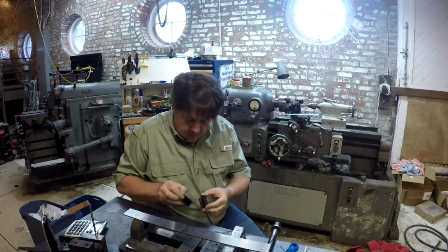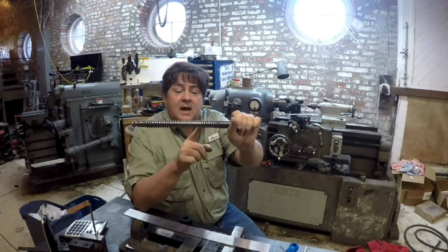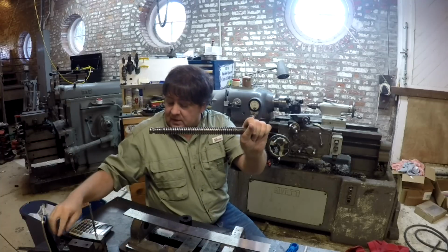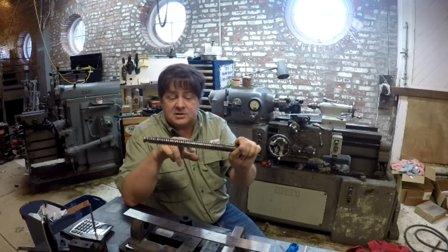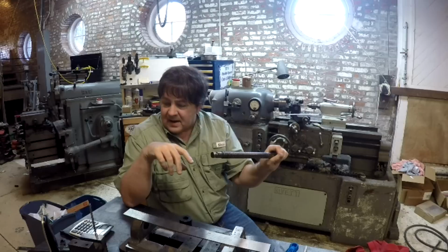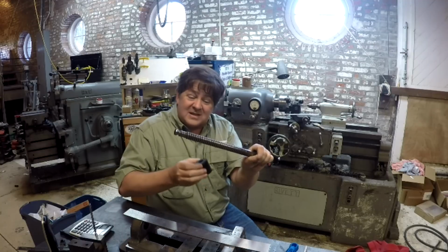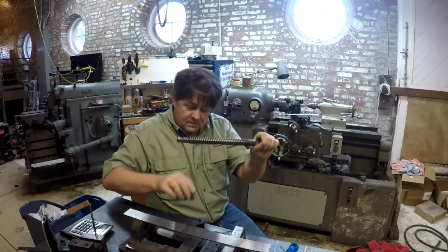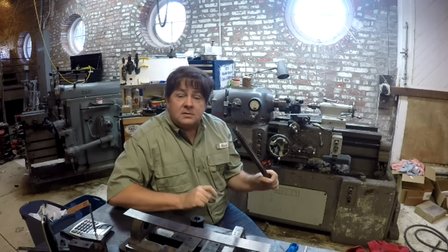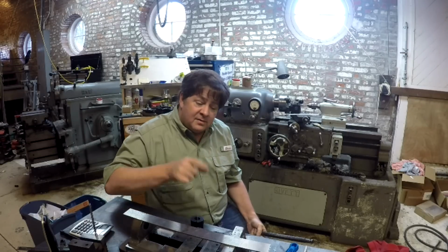And what I'm going to do now, I took the lead screw, the screw in this case, and I cleaned a section very thoroughly with a brass brush and acetone. I've then coated it with a silicone mold release agent. We are going to place all of this in a vise with the 2 sections pressed up against the screw like so. We are going to take a heat gun, not a torch. We're going to start to apply heat to the screw while we tighten the vise.